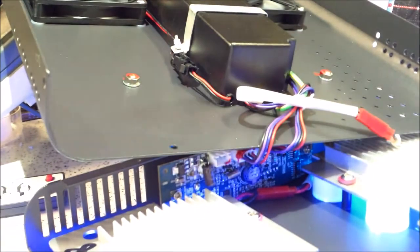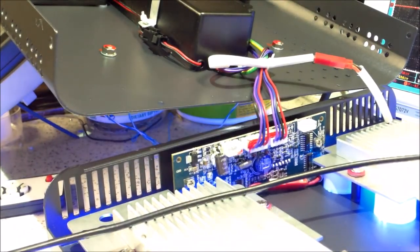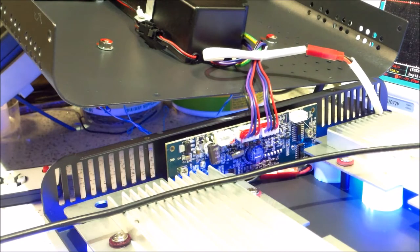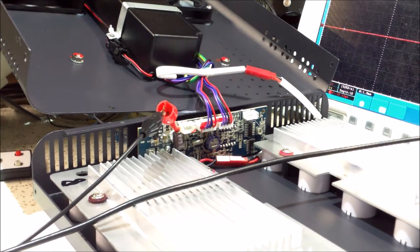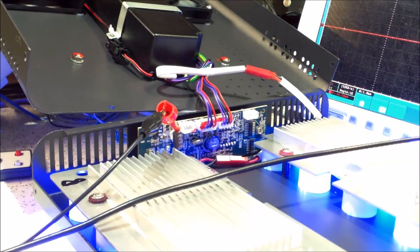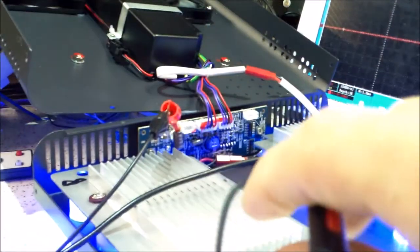Okay, let's see if I can get this set up here. At this point I have just channel one on at one percent. Let me grab a ground extender here. I have the LED set up and the scope on in the background. I'll flip it on — I have the blue channel on at one percent. I have this wire here to extend my oscilloscope ground and I'm going to attempt to probe the dimmer wires and see if I get anything out of it.